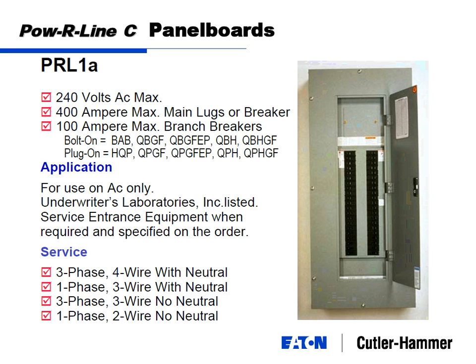A little bit different than breakers. So when we talk about panel board, we almost always then look at the bolt-on line, and our family is BAB, the fighting line of the 20 amp one poles. I think we make a million BAB breakers a day. And then a couple of different variations with ground fault, the GF. This is a 10,000 amp AIC, 10,000 amp short circuit breaker. Our next level up is a 22,000 amp.